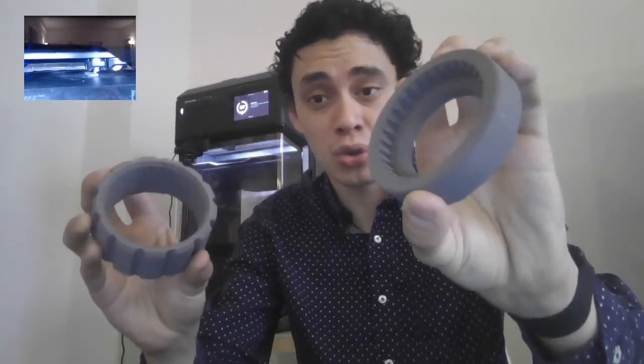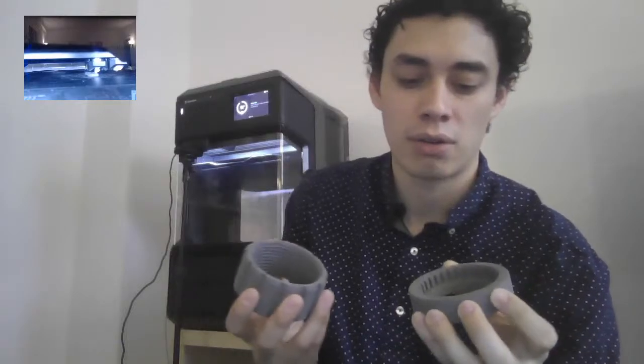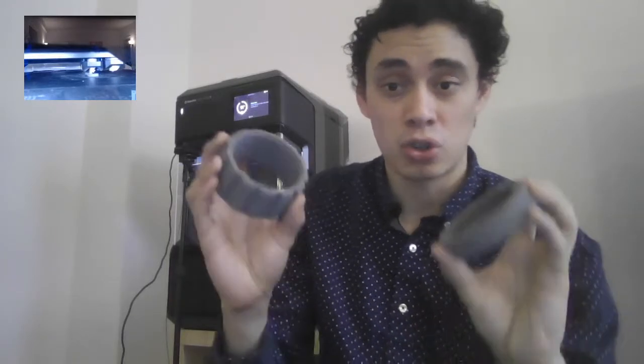So it's true that this material can be used with other platforms. We've seen other desktop printers offer it as well. But the fact that with Method, you just get that much better resolution and accuracy makes you start with a much more solid state of affairs. Prior to sintering, prior to debinding, these parts are already really, really accurate. So going back to that conversation around the scaling and warping issues during the debinding and sintering process, the fact that you're starting with a part that's already really close to spec allows you to have better results after the sintering process has been completed, right? As I said before, with all of the parts that I measured, it's not more than 100, 200 microns deviation at most. So really, really great and consistent results, I would say.